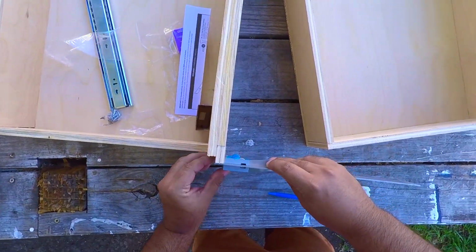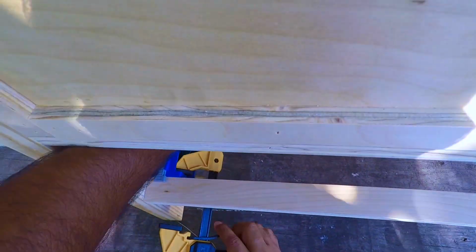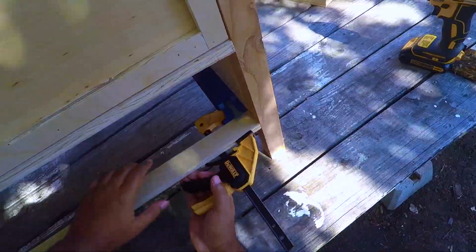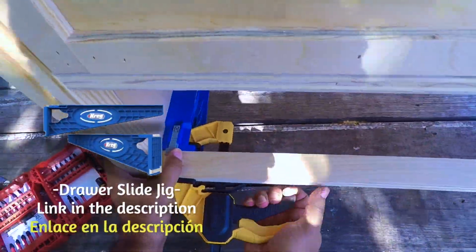For the drawer slides, I marked the thickness of the trim, and that's where the edge of the front of the slides will be placed, so that when the drawers are closed, it will be flush with the body of the nightstand. And I also use this jig to help me align everything, and I have the link in the description if you want to check it out.